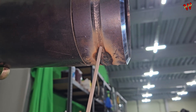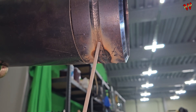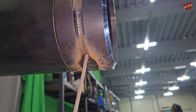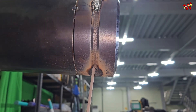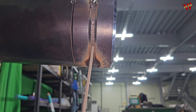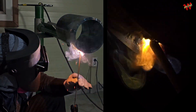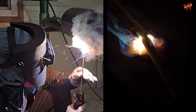Here is the most important part. Generic welders sold at the hardware store can't melt the rod properly — and overhead especially, for small-diameter rods, low amp control is impossible. The rod doesn't burn right, so the slag and puddle don't separate. Most of those machines are just glorified flat welders — that's why the rod sticks and the slag sticks. If you practice without knowing that, you can practice forever and go nowhere. Choosing the right machine is critical. Power plants use Daeho, C Engine, ISU — these are the main players. There's a reason pros use these. When you're doing overhead, the difference versus a cheap welder is night and day, especially on 9-chrome pipe — you need that low amp control.